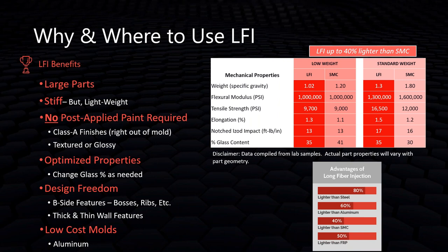Because it is a match-metal mold process, you get B-side features like bosses and ribs. Being a polyurethane RIM process also allows thick and thin wall sections within the same part. Picture a flat rectangle where one half is three millimeters thick and the other half is eight to ten millimeters thick — that is achievable. You are not limited to working within a nominal wall thickness.